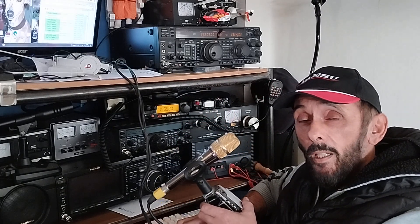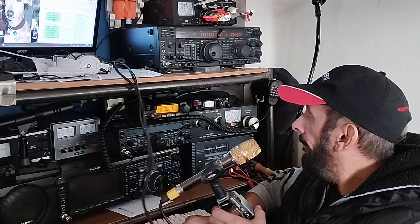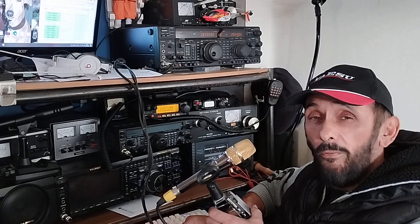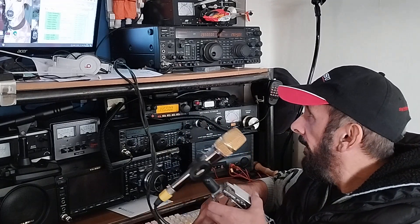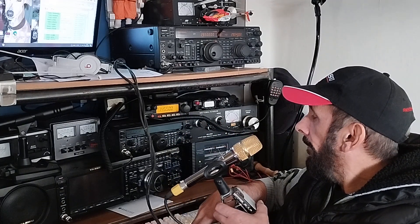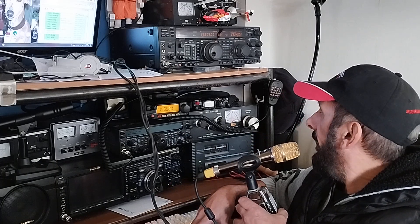I'll show you the antenna - it's an old tank whip, a nine foot stainless steel tank whip. I've not made a contact yet. I've noticed it's resonant on 10 meters and 12 meters, and it tunes on about 2:1 on 15. So it tunes with pretty good SWR. Hope to meet you again, maybe on another band. Thank you. Mike Zero Yankee Kilo Sierra.